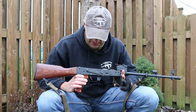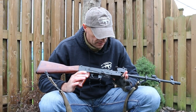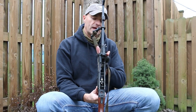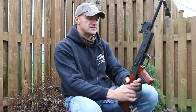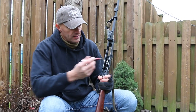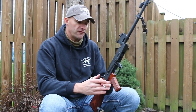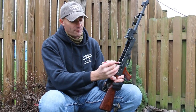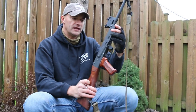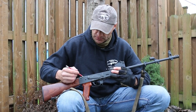Check if it's rusting or not, then do a general look inside the receiver. Go quickly over the rivets, look at the barrel and trunnion to make sure everything looks okay. Look at the receiver from this angle too — this is the best way to see if the receiver is deformed anywhere. I have seen brand new rifles from well-known manufacturers with bulged rails. The rifle may function, but for a new rifle there is no excuse — that's a no-go.